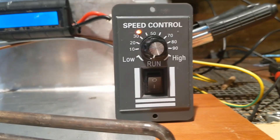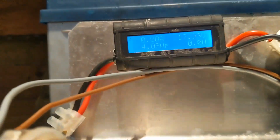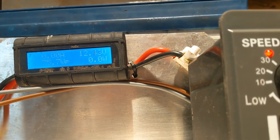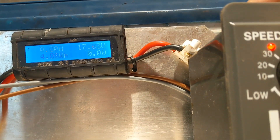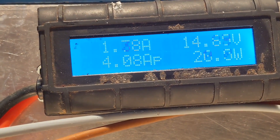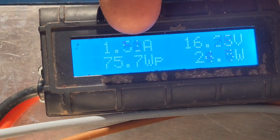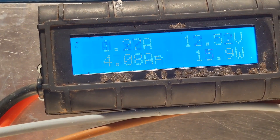I've got this dump load and this speed control, and what I want to show you is what effect it has on what the turbine's producing — there's no battery connected. So I'm going to concentrate on the meter. If I turn it to 10%, what you're seeing now in the top left is the amperage that the dump load is drawing, and that's what the wattage displays. If we turn it up to 20, the amperage has gone up.